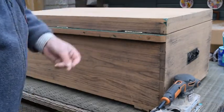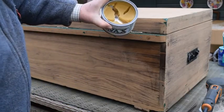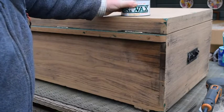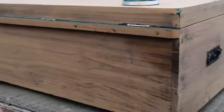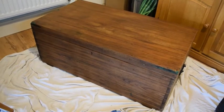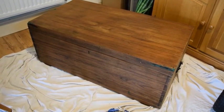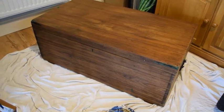And that's it — once that's brushed off it should be as smooth as a baby's bum. The wax is a little bit solid so I'm going to put it inside the house for a few minutes for the central heating to soften it. I've now applied one coat of wax to the old chest and we'll let that soak in, then buff it up and probably apply another coat. This really does show off the old original dovetail joints, showing how well it was made.